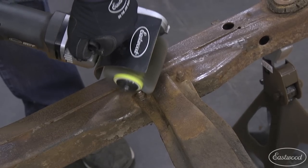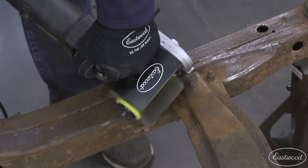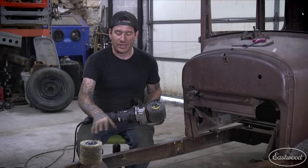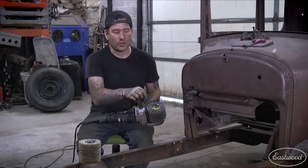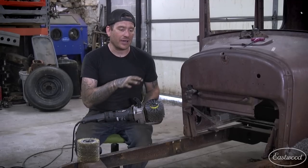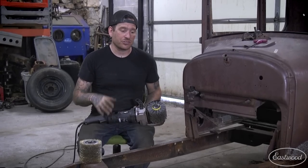The nylon drum is a little more flexible, which works for getting around irregular surfaces like rivets, bolts, and things like that that some of the other drums would get eaten up by. But it was not quite as aggressive as the wire wheel because it did not get into the pits quite as well. So with a couple of passes you could probably get a similar result, but it's not going to get out the pits as much and it's not going to work quite as quickly.